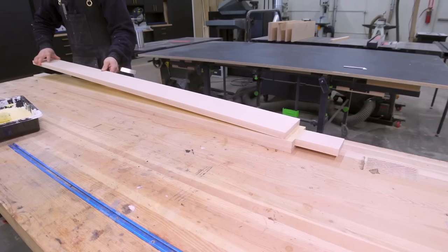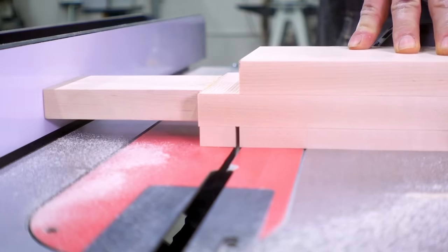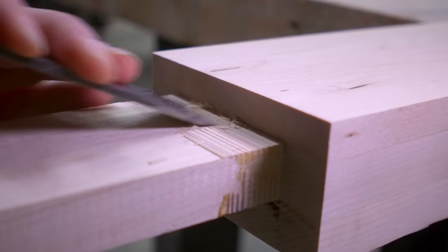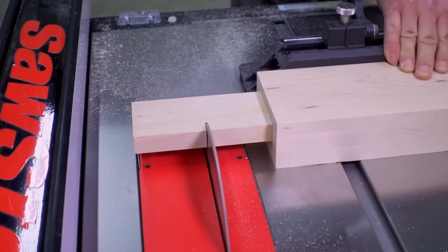Don't jump the gun yet. We still have to hand cut a mortise into one face of each column for the mid rail to connect to. We need a mid rail though. I pre-glued everything together with the tenons in place during the first processes we already covered. This mid rail is the only other maple component because people will likely rest their feet on it. The mid rail will get the same taper as the footings, but by now I'm anxious to get the mortises cut so I can fit the tenons, so I'm switching gears.